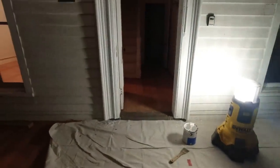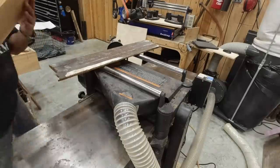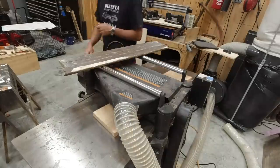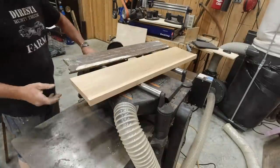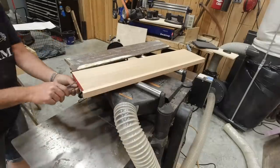This is the entrance to the house. It had really elaborate molding which was missing a big piece. You'll see there's a piece missing on one side — I scraped and primed it, kept seeing where it needed work. I also make the threshold: we rip the old one up, and there it is — a nice piece of oak, one inch thick, that I had to mill down to about seven-eighths of an inch.